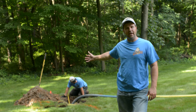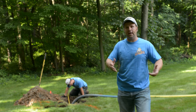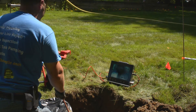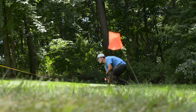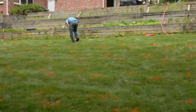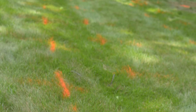We located one of the drain lines and it's just completely saturated. What we're doing right now is pumping all the liquids out of the drain lines so we can see what's going on in there and where each individual line is before we start our probing. All the lines have been located and vacuumed out. We've marked everything — the complete field — so we know where to aerate next.